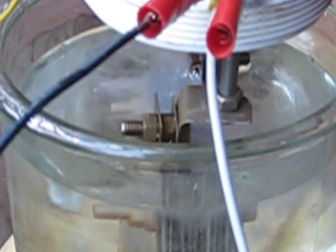It's barely moved — about 500 milliamps. See what kind of reaction we get in the cell. Here it's starting already. Cell voltage went up to 20.1. Frequency is at 5.57. Duty cycle 76.6. Let this run for a little bit. Some really good activity at the cell, it's just boiling out of there. It's just fresh tap water, first time it's ever been used.